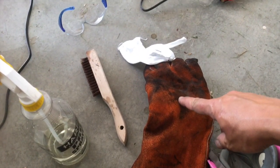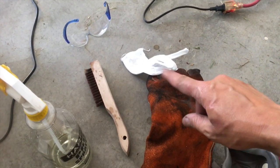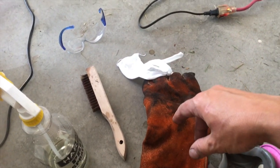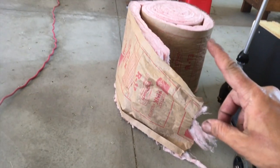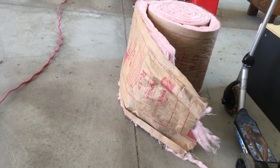For safety equipment: you need your glasses, you need your breathing equipment, and you need a welding glove — at least I use a welding glove for holding the pot with my left hand. I tin by wiping with a cotton-gloved right hand — vice versa if you're left-handed. And last but not least, either solid cotton or insulation like house insulation for the actual wiping.